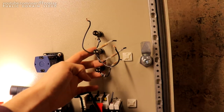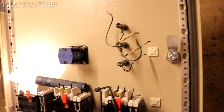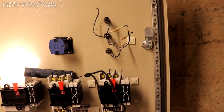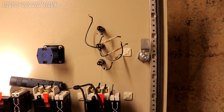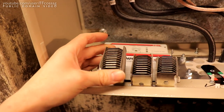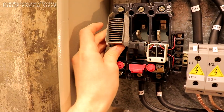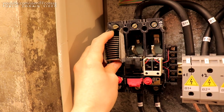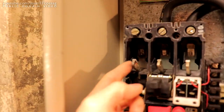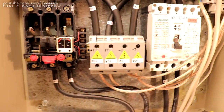I've got three lights on here, so I'm thinking I'm going to wire them up as: battery one on, battery two on, and a fault indicator - something like that. These are little old LED lights. I don't think I need to modify them for adding different resistors to make them 48-volt compatible. If you're curious, these are the spark arrestors for the breakers - they go on top of the terminals and help dissipate any arcing that might happen when 600 volts DC is disconnected. You can see there's a ridiculously large isolation gap - these are properly serious breakers.